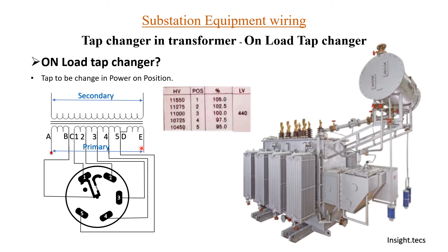The basic principle of transformer tap changing is: if you want to increase the voltage, you need a higher number of turns — bigger the winding, higher the voltage. If you want to reduce the voltage, you cut down the winding — less turns means less voltage. At position 1, the voltage level is highest and the winding connected has the largest number of turns. The current path flows starting from A to point E.